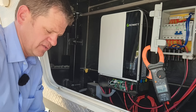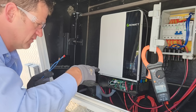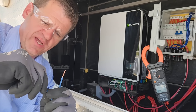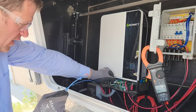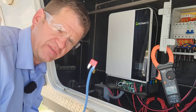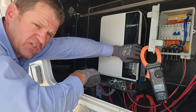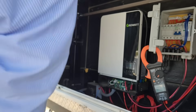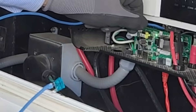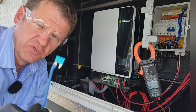Now let me show you how much power is going through this. It's really sporadic — sometimes there's power and sometimes there's not, so you could test with your meter and then a relay might switch state and send power out. Here's a 10 amp fuse — I'm going to connect it to the positive PV terminal and touch the frame. Holy crap, it blew the 10 amp fuse. That's enough to kill you right there. Anyone could just be touching the side of their unit to tighten a solar wire and get shocked. I'll try one more time with a 15 amp fuse — and we just blew the 15 amp fuse as well.